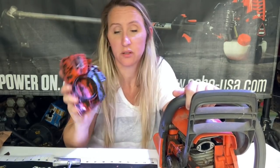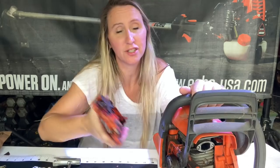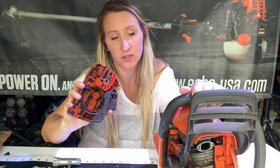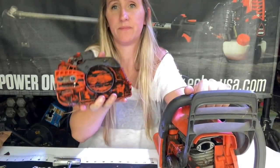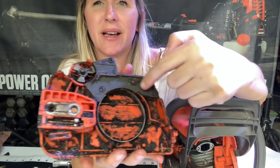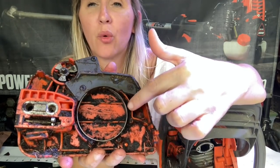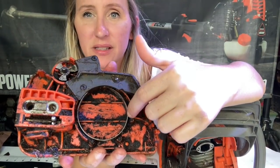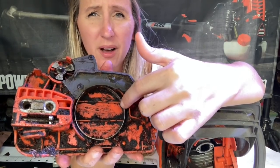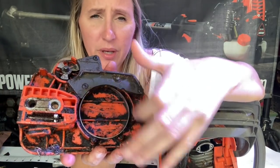That's a lot of work. So stop — if you feel like it's that hard to get off, there is a reason it is not coming off easy. It should just slide right off. If you have your chain loose enough, there is no reason you should ever have to pry your clutch cover off. So after prying it off, you fix your chain, you do whatever, and you go to put it back on. Well, this is your chain brake inside. If the chain brake is still engaged, this tightens up around your sprocket to stop it — it won't let the chain turn anymore. When it's this tight, it's not going to slide right back on the sprocket like it should. So we're going to have to disengage the chain brake before we can get it back on the chainsaw.